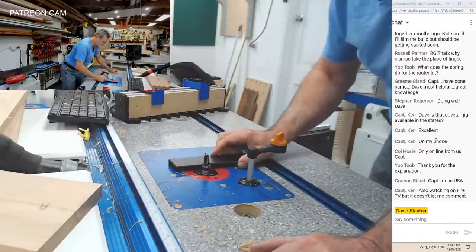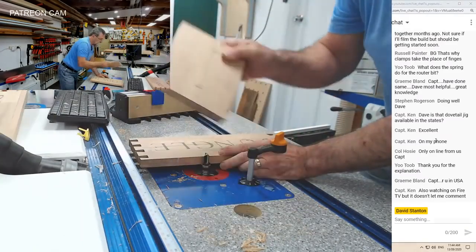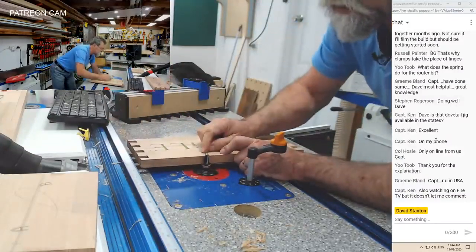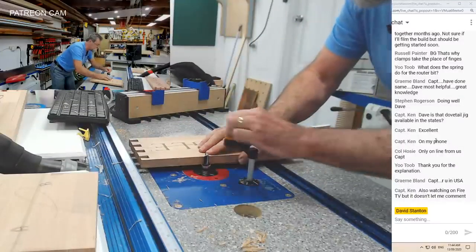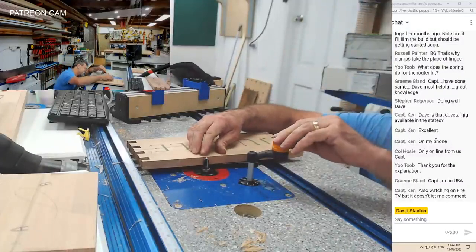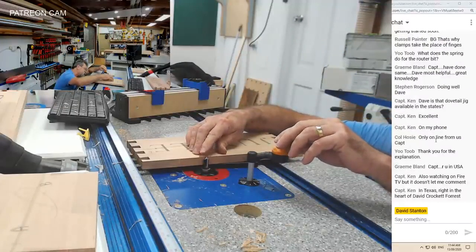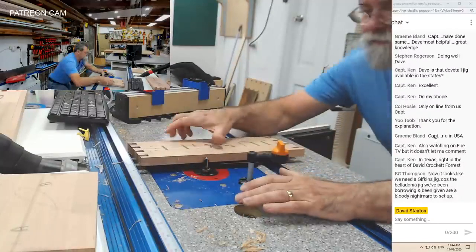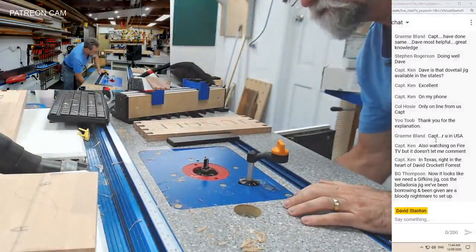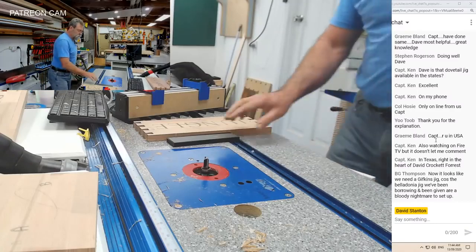Use the packer. And this, because this is the part that the pins are going to go into. So we're going to be cutting the pins, so we've got to have the thickness of this. If these were different height thicknesses, that's when this part would really come into play. Where are we? About half a mil. And because all this timber has been machined through my thicknesser and drum sander, it's all parallel. About there. Lovely, lovely, lovely. And lock it from underneath. Beautiful. Take that out. Over here. Close this. Move that out of the way.